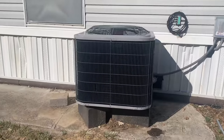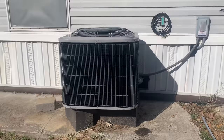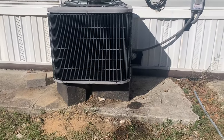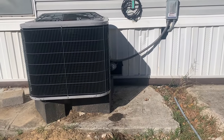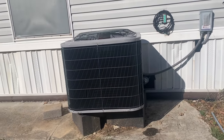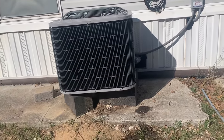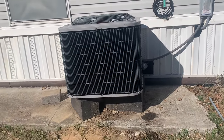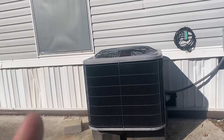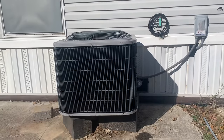All right, so a real quick summary. Change the condenser coil, put a new filter dryer. The evaporator coil does leak. He knows that. It's not under warranty. FYI, I did not put this unit in, and I did not put the evaporator in. The customer is also the one, he did not have the compressor replaced. He bought the house recently like this.